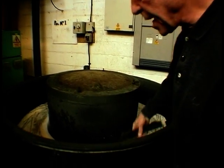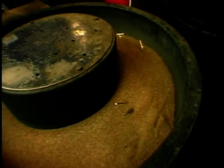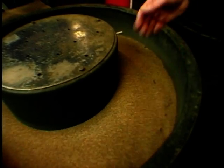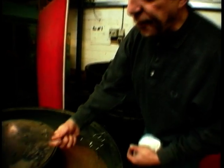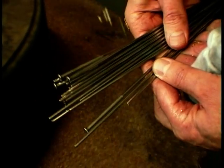So we'll just tip those in onto the polishing roundabout. After it's been on the polishing machine, it then comes into this, which is a bed of maize, and the maize is actually drying off the spokes. So it's still got a few chippings in there, but you actually get beautifully finished spokes, just like that, twinkling away there in the light. Beautiful, enough to make anyone proud.